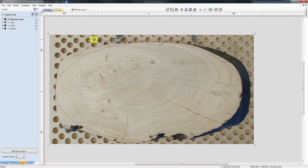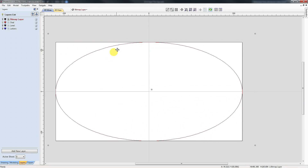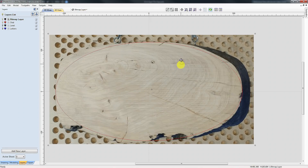It's important when you're doing this that you are actually moving the picture and not the oval. The oval needs to have its center point right here at X0, Y0, right in the center of the oval. What we're doing is moving this piece of wood so that it's right in the center. We can easily measure across and up and down and find the center point of this piece of wood, which we're going to use as our reference.